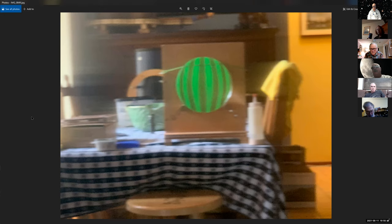Usually what happens is you get the rim of light. If you're introducing the knife edge from the left side of your tester, you'll get a rim of light to the right. And if it doesn't go all the way around, it means you still have a turned edge. Well, in talking to Tom today, he was saying, I don't see any evidence of a turned edge. He says you're just not fine tuning your knife edge. He just doesn't think it's turned.